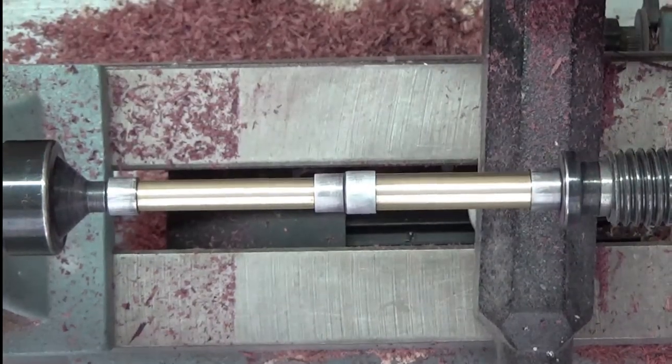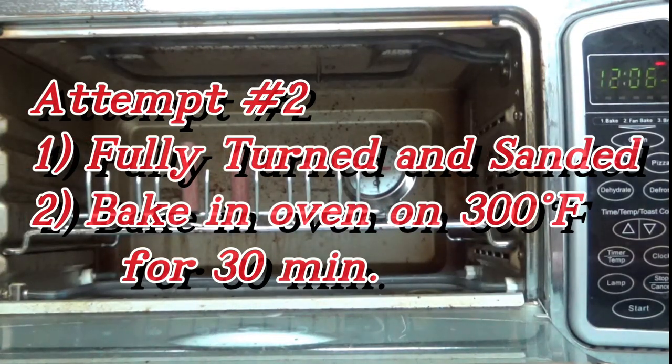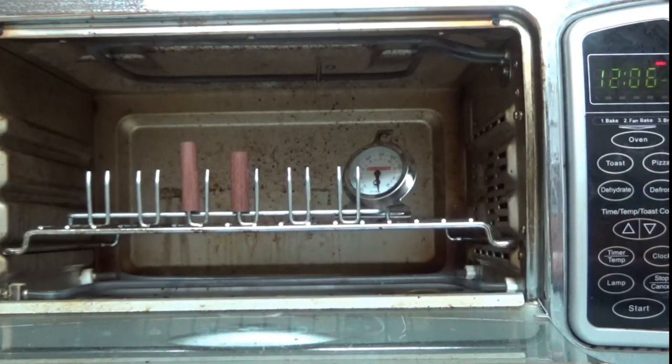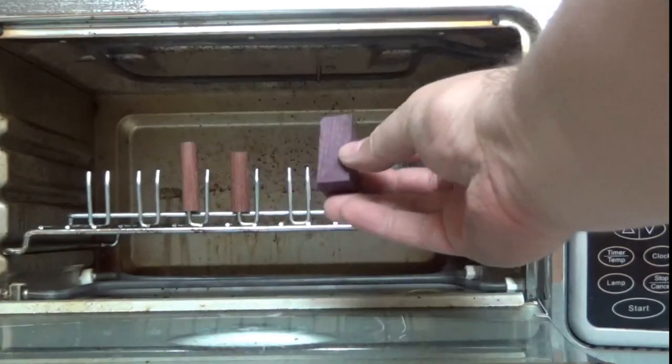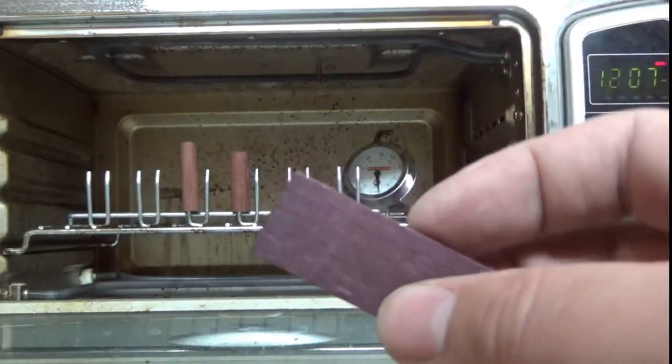All right, that's how you do a blank reset. So here the toaster oven is your friend. This toaster oven I have designated just for doing wood and resin and different things. I have a rack set up to hold the pen blanks upright, and in doing so it'll allow the heat to travel up and through and get around and completely turn the wood dark purple — going from that brown color to a nice deep purple color.